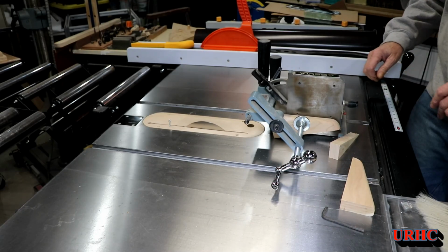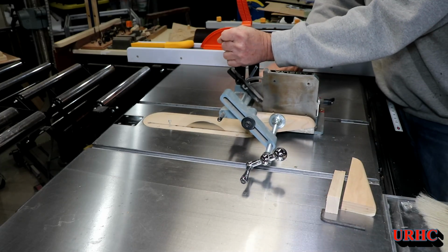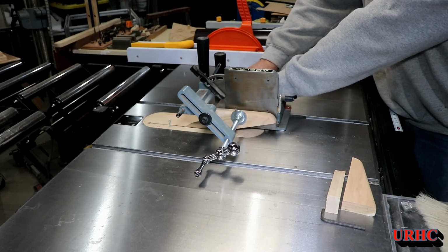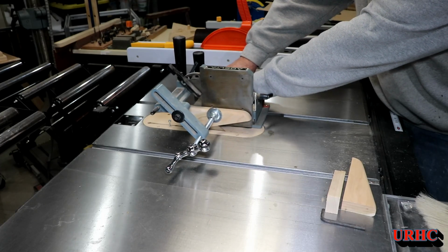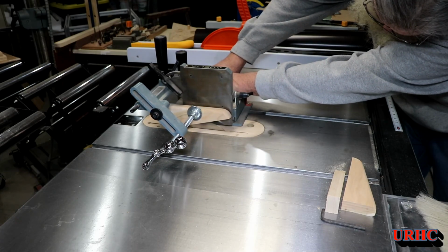Then I'm going over to the table saw, and I took one of the 1/16 inch thick blades from my dado set and put that on the saw by itself. You can hear it sounds really funky there because it's only got 6 teeth on it. But it does do the job that I needed, to cut the slots in these brackets for that metal bracket to fit in.